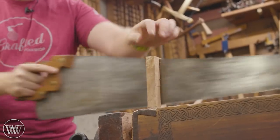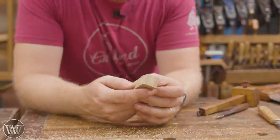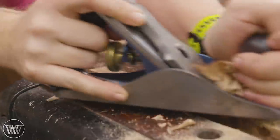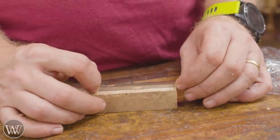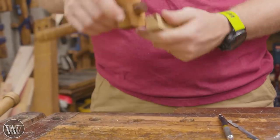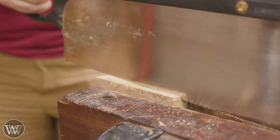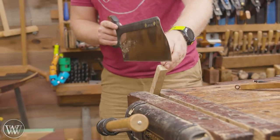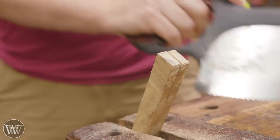This is a good bit bigger because I need to clean it down smooth, and I'm going to make a kerf right down the middle so that I can sandwich the blade on either side. The easiest way is to cut down off-center of the block. If your iron is a 16th inch thick, you'll want to move off-center by a 32nd of an inch — or a little bit more because you're going to have to plane off the surface. I'm setting the thickness of the blade and putting a mark down it to rip. I'll use a thinner saw — my tenon saw will work very well. A lot of tenon saws are a bit fat, but this one is a very nice thin kerf and leaves a clean line.